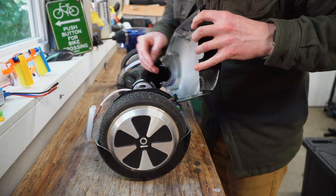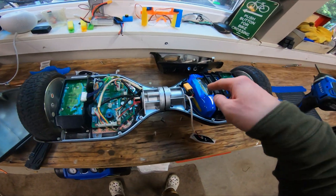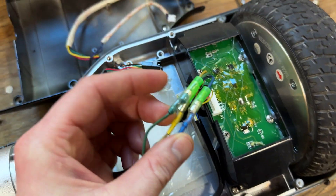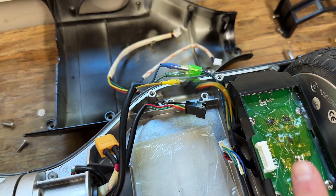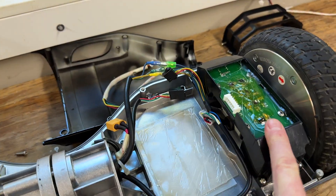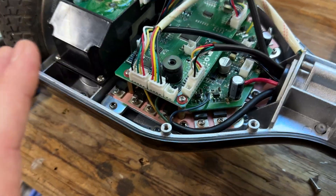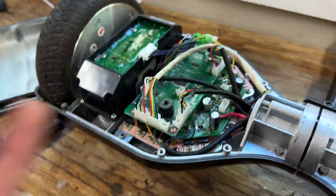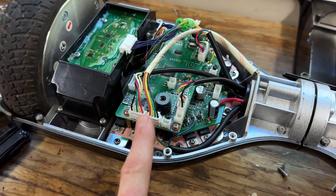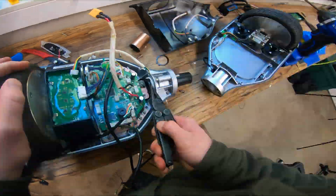What we've got going through here is just a tunnel — there's one battery and multiple control boards. Each of the drive unit motors has three signal wires running to the main control board. So the gyro and position sensor are in here, and this contains the electronic speed controller, which delivers current from the battery to the motor. I will have to preserve this in my design and put it all in one package along with the power source.